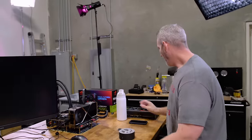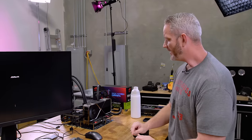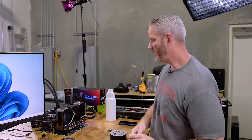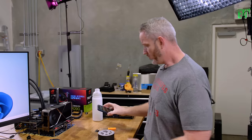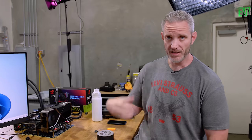I need to look into why we can't get the Strix card to load up on this motherboard. I have a feeling that if I took the CPU out and stuck it on the ROG board I have, it would work fine — it's all going to be internally vetted and made to work in their own ecosystem. I think this is just an issue between this VBIOS and this Tai Chi, and possibly even this monitor since monitors play a part in this too.